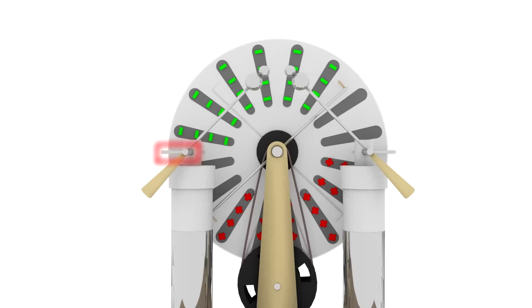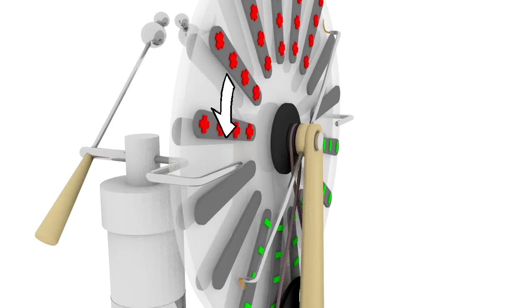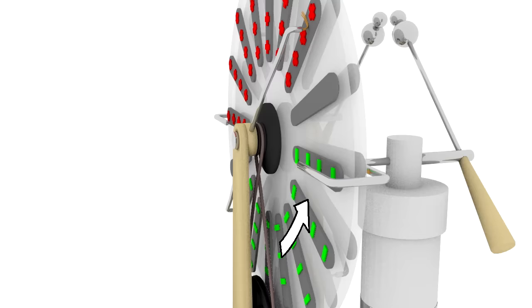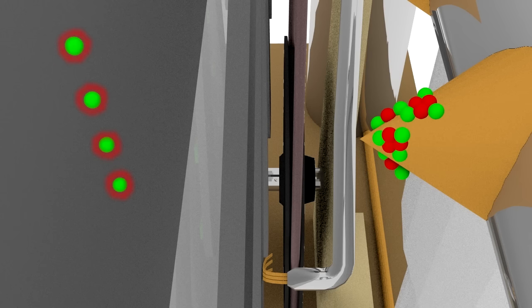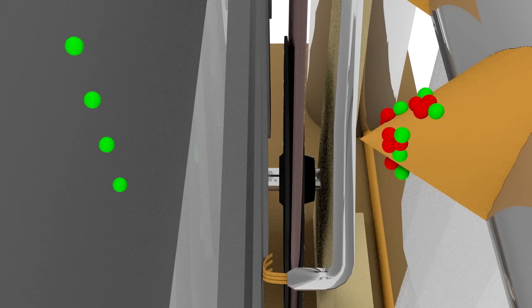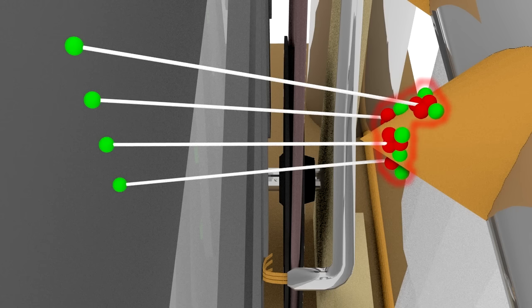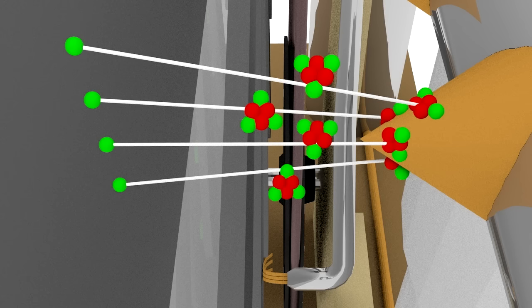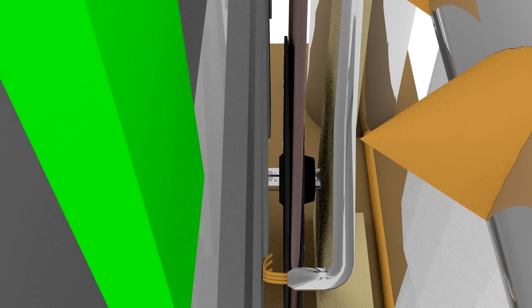On the left and right sides of the Wimshurst machine, we have what are called collectors. Their job is to collect the charge. Only positively charged sectors are moving towards one collector, and only negatively charged sectors are moving toward the other. These collectors are U-shaped, with sets of sharp metal points on them facing each disc, called combs. Using the negative side as our example, the negative charges on the sectors repel negative charges from the sharp points, leaving them positively charged. Those negative electrons go to the rest of the circuit. There's an electric field between the charges on the sector and the charges on the sharp points, and since the charges are crowded together at the sharp point, the electric field is stronger there. That strong electric field attracts electrons from neutral atoms in the air, and also from the sectors, leaving each sector neutral again as it rotates away from the collector.